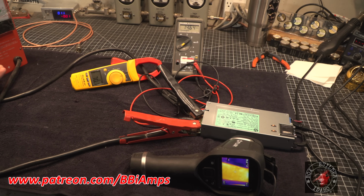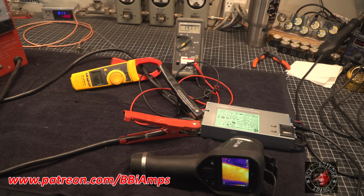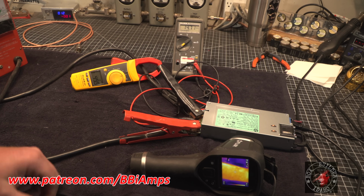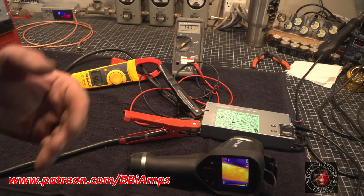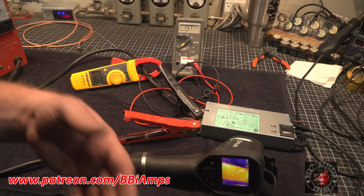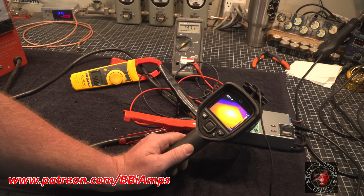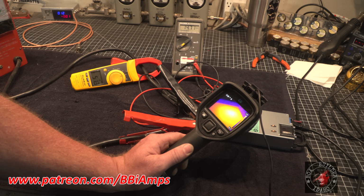There's the fan. So now let's back our load down. Back it down to about 50 amps. And we'll see how long this can run before it goes into shut-off mode. That's what it used to sound like all the time. You've got to remember, us radio operators, we're not putting a constant load on the supply like this. We're at 120 degrees Fahrenheit, and we're gaining ground in the temperature department.